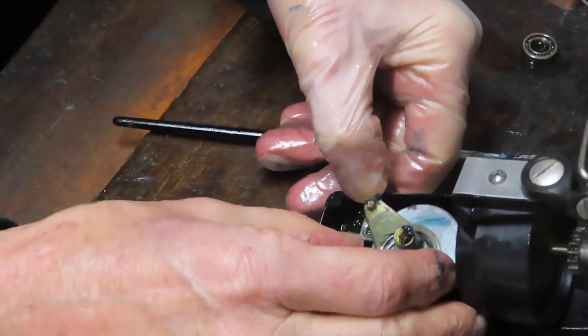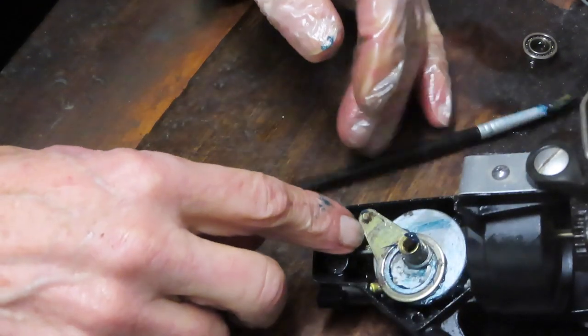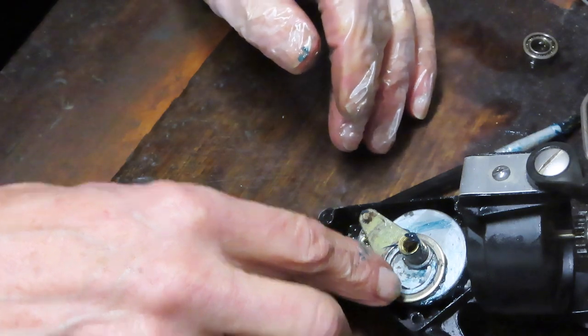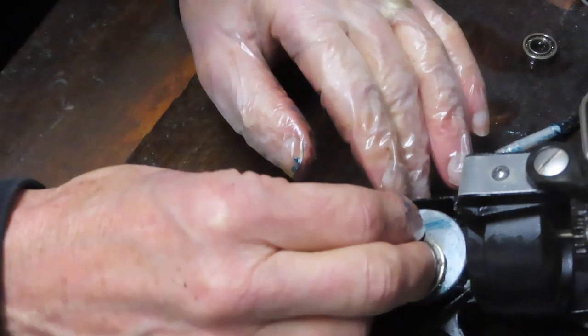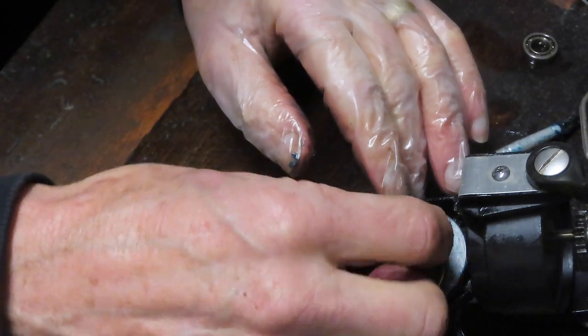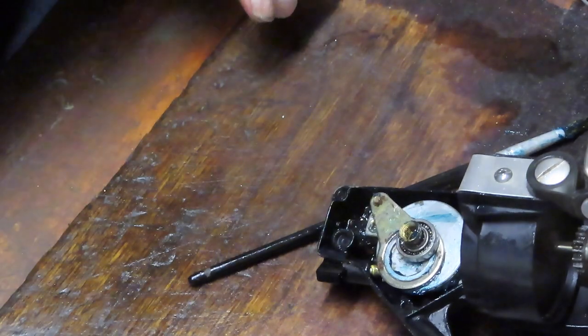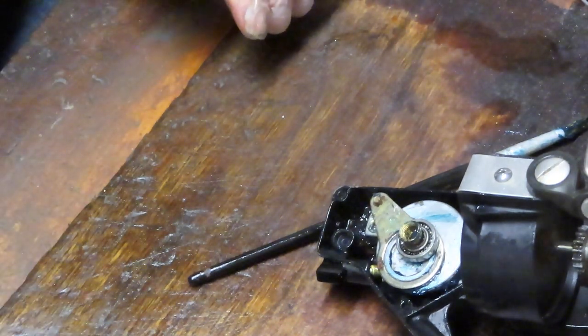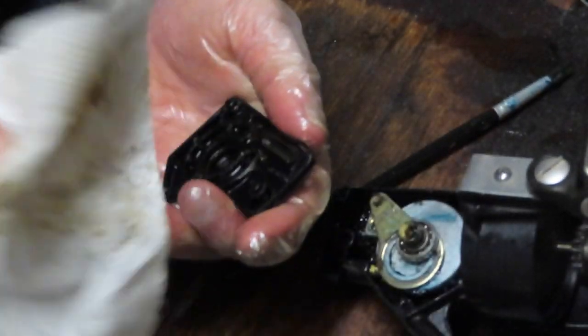Okay, we want to press down to make sure that we anchor the crosswind arm into that block, also on here. Then we had a small shim washer that's going to actually hold that in place. And then we had that bearing that we took off before. Last thing then, I got to clean this case. And it was just a little bit of overflow of grease there.